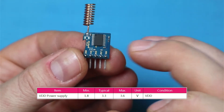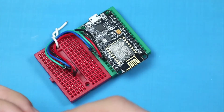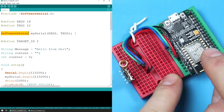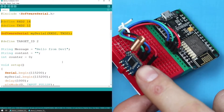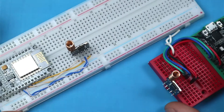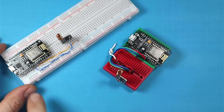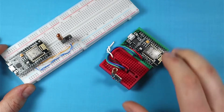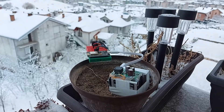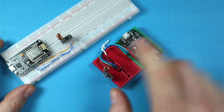That's the reason why I chose to integrate this board with a NodeMCU board. I'm using software serial on the NodeMCU to talk with the LoRa board, and that is then transmitting data to a second pair of NodeMCU and LoRa module. The way I have set up the devices is that this is device one and this is device two. Device two will be sitting here in my home, placed outside on a window so it doesn't have any obstructions. Both of them will be powered from power banks.